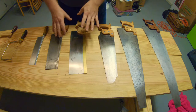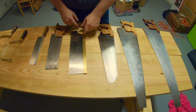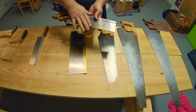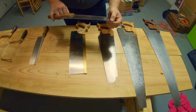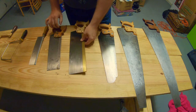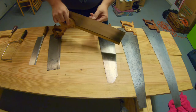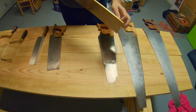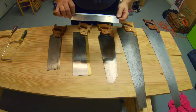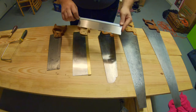This is for cutting down the length of boards rather than across the grain. The teeth are filed almost like chisels. This is another rip cut panel saw that I made for smaller work. Then we have our back saws - they're called back saws because they have a stiffening back. Again, your miter saw has fairly fine teeth for slicing through the grain crosswise. This is a smaller tenon saw filed rip cut for cutting down the cheeks of your tenons. Then we move on to one of the smaller back saws, which is a dovetail.